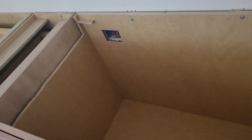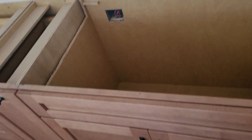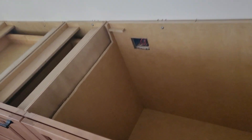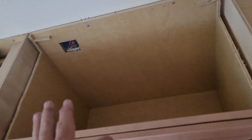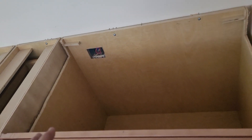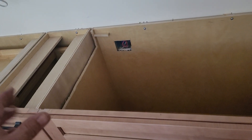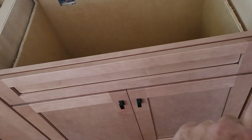On this one we've got a 36 sink base. Really important to know: a 36 sink base no longer fits 36-inch cooktops — this has been the case for about a year now. They've started making the chassis of 36-inch cooktops at 35 and 5/8 to 35 and 3/4 inches, so the interior of a 36-inch sink base must be scooped. If you don't do this before granite is installed, you'll have to come back and do it after, which is much harder. Make sure you put a note for your installer: scoop the sides or the cooktop will not fit. That's almost universal now.